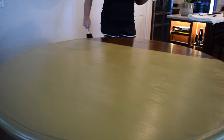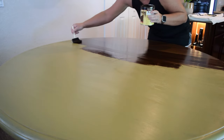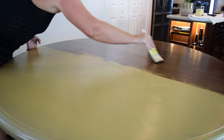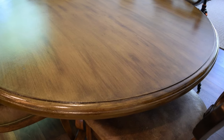I've done this a lot, but never on a flat expansive space like this. What you do is brush it on — I'm using simply for the first application a sponge brush, and then you just drag that stain with a bristle brush to get this detailing of wood. And voila, I was thrilled. It turned out almost a perfect match for the rest of the table.